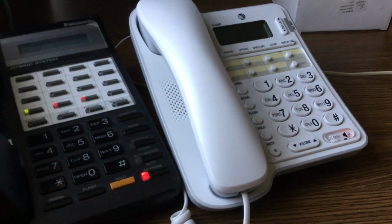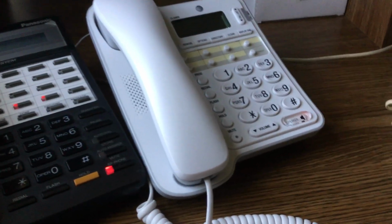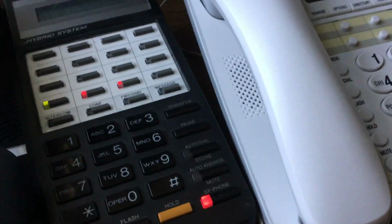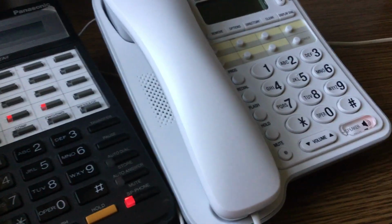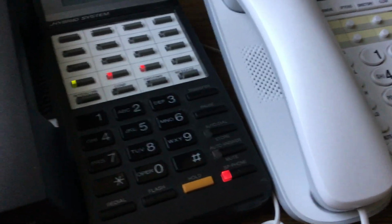So, now this call never went out to the PSTN, even via Google Voice. This is just going back between CNET and PSTN. So you can hear that those tones still echo, but they echo in a different way than they did when I was tandem stacking between CNET and PSTN and the PSTN via Google Voice. And this time I was using a different routing. So, different numbers. And the connection sounds different.